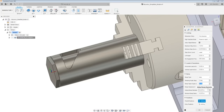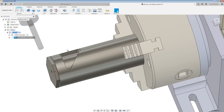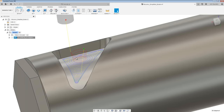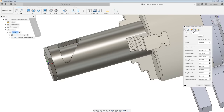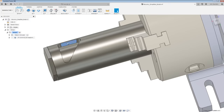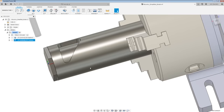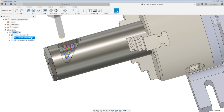I'm going to add a ramp taper angle of eight degrees, which creates a slight taper that really helps with chip evacuation. We're running this dry for video purposes, but normally I'd recommend MQL or flood coolant. By default, 2D Adaptive leaves some radial and axial stock — that's intentional because adaptive toolpaths are not finishing strategies. In this example we'll set the axial stock to zero, which still leaves 10 thousandths of an inch along the walls. I'll use a 2D contour to clean those up using a neat trick: right-click, create derived operation, 2D milling, 2D contour, then remove the radial stock to leave. It has inherited the features from the Adaptive — the contour and wrap toolpath selection — so we're good to go.